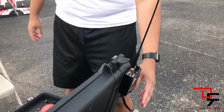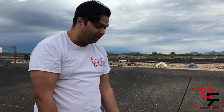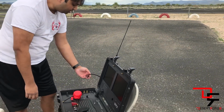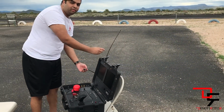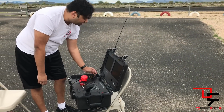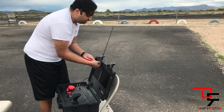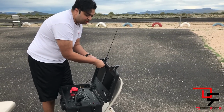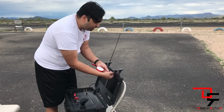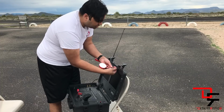This is Dragon Link. We can output to really any transmitter module out there. We have an internal bay for modems, satellite technology, so you can really use whatever you prefer to fly commercial UAVs. So this is a Dragon Link transmitter, 433 long range. I'm just going to plug it in, 12 volts, and then the signal pin, and then also get the antennas on. And that's all you really need to do to have a full turnkey system that has all the features that you need to operate simple commercial UAVs to really high-end, complex UAVs, all in one box.